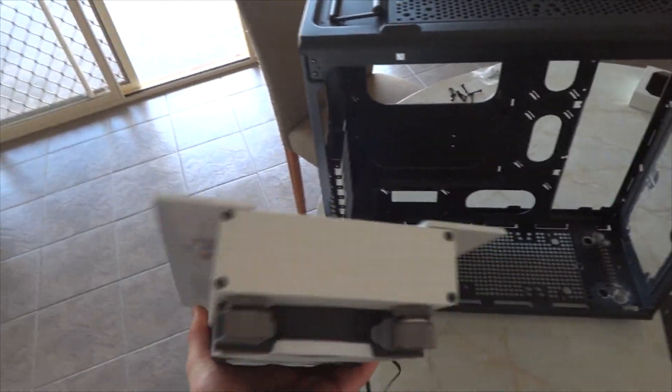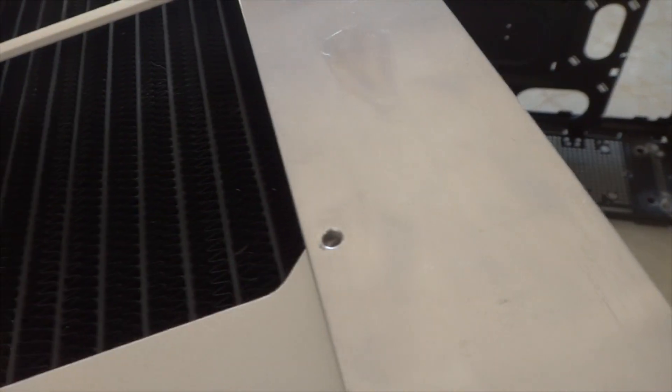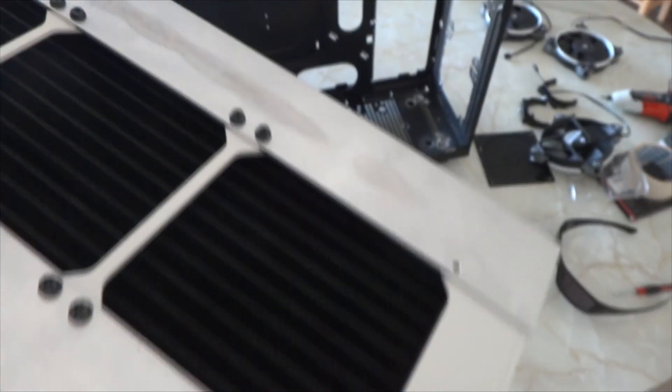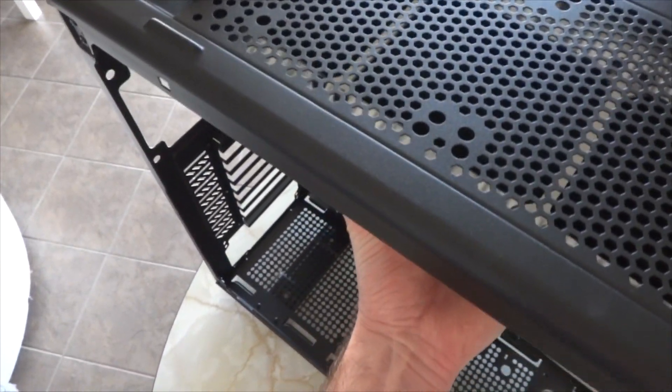Here's the bracket I came up with. It's pretty self-explanatory — it's just two 50mm wide pieces of aluminium. Holes drilled there, there will be a hole there, screws mounting those ones. They just need to be countersunk, so I'm waiting on the bolts, but they'll be countersunk nice and flush, and then this will be mounted up in the grid like this.